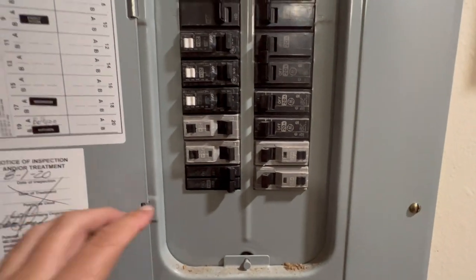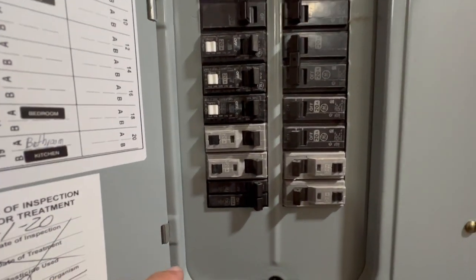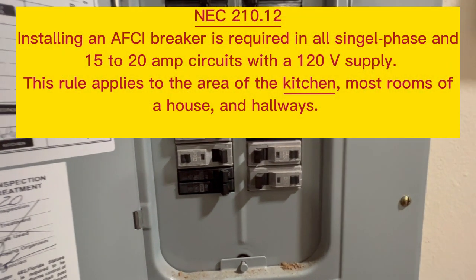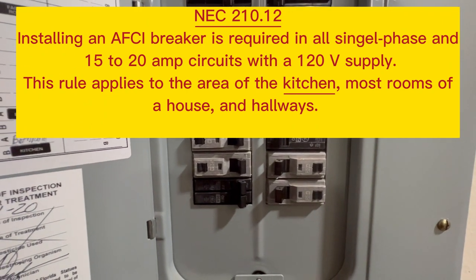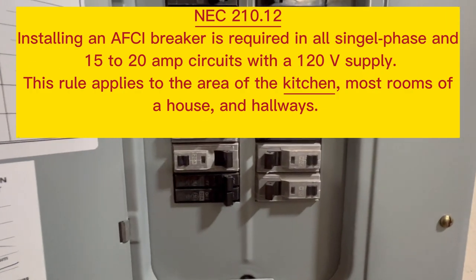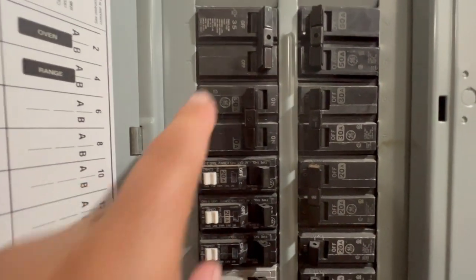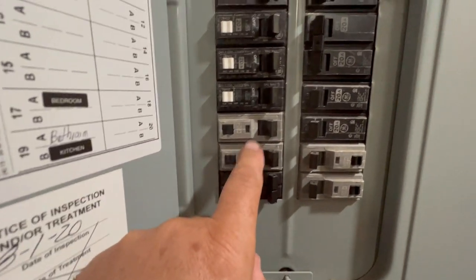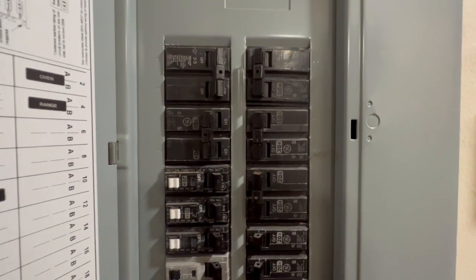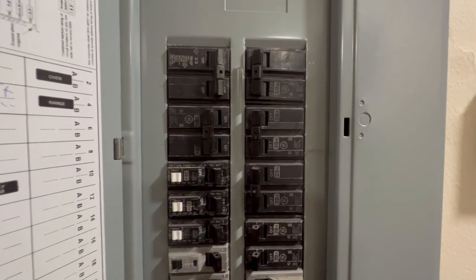Here's my circuit panel. We have a bunch of 20-amp breakers. The one that keeps tripping is this one — it's on an arc fault as required by the code, but also the kitchen lights and everything else is on that circuit. I just want to put that four-gang outlet on its own. Right now this 30-amp two-pole is not being used. I'm going to pull this one out and add another one just like it in its spot. We're just going to plug in that two-gang, four-receptacle outlet onto it, and then I'm going to separate the wiring. I'll show you up in the attic.